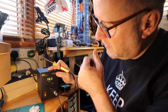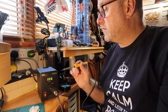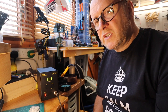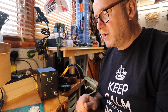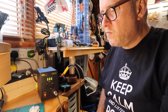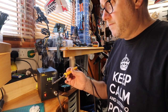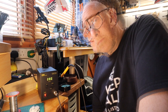Turn it on and you can see the active temperature reading. Press the up button and it's going to 390 degrees centigrade — the tip is climbing to 390°C. I haven't checked the exact accuracy; I go by feel. If it needs to be hotter I turn it up — for battery plugs I might go up into the 400s. Don't rely too much on the temperature gauge, it's a reference only. And there you can see the lead fumes — you're not supposed to breathe that smoke in.